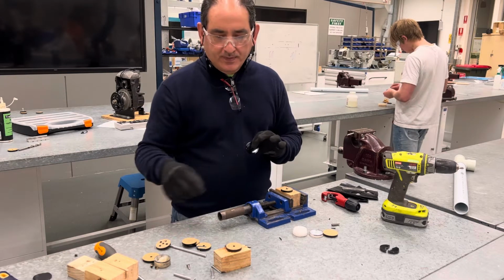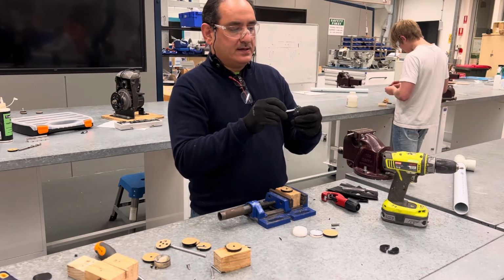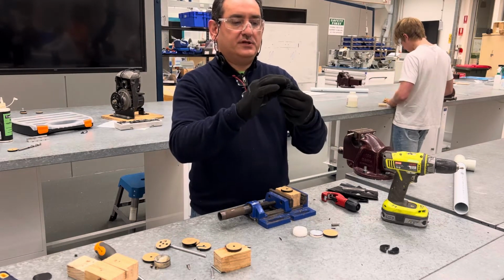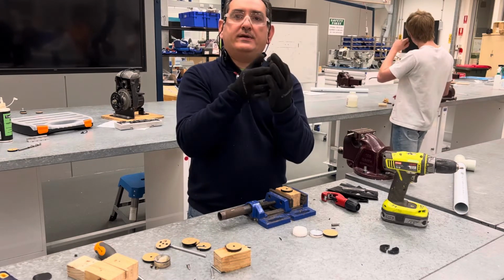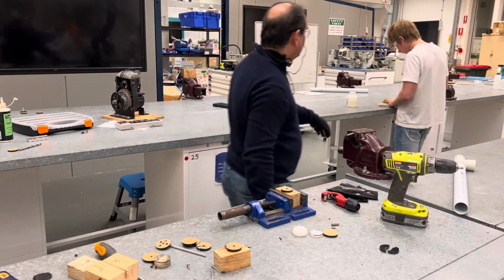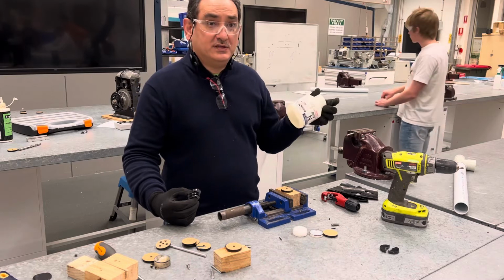It's very simple. I can use a pin. I can put it in the first drilled hole I'm going to make, and it's going to be the dial indicator. So I know that they're not being drilled together. So the pin on one of them, then when I dial them, they're all going to be in aligned holes. The same pins are going to be used later when we glue the parts.